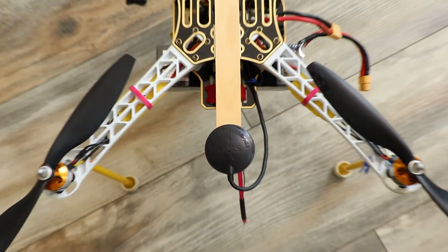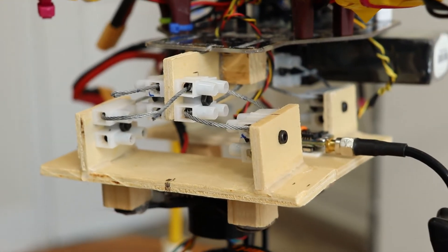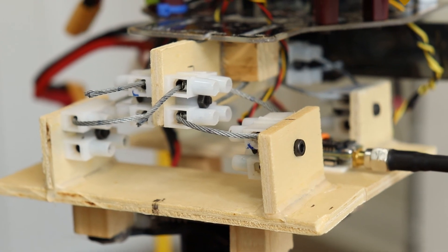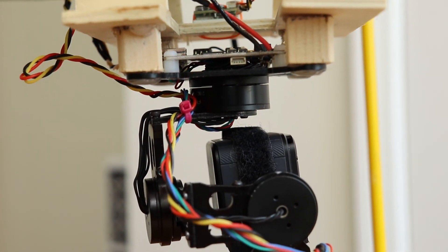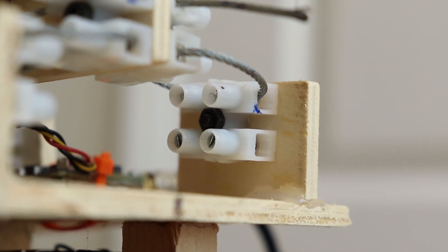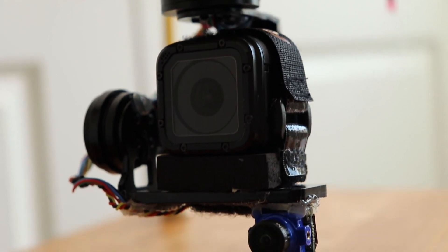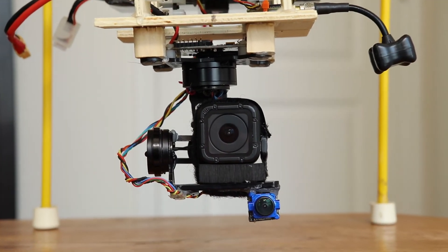It also is safe between the two rear arms from crash damage. Two, vibration isolator design — to address the issues listed, I built this vibration isolator platform. It is constructed of wood, steel cables, and terminal blocks. This also pushes the camera a bit more forward in hopes to avoid seeing the landing legs in the video.